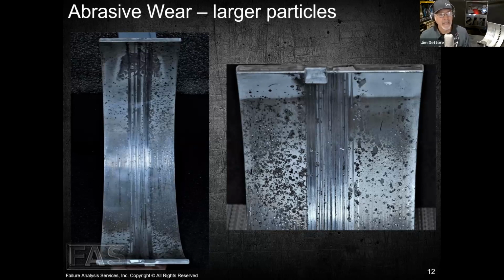Another way would be that we take a cylinder head off and we don't clean the top of the engine and the outside of the engine before we disassemble it. So as you're disassembling it, debris is going in. And then if we're not careful in cleaning processes, such as using gasket scrapers or die grinders with roll-lock discs or Scotch-Brite pads, we need to think about when we clean, where's that stuff going? Is it going right into the sump? We need to do everything that we can to keep those areas as clean as possible.